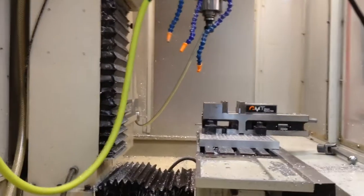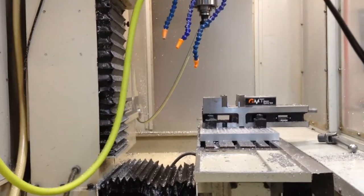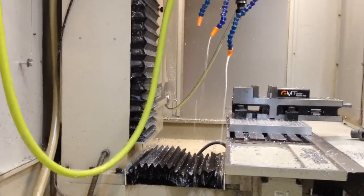Let's turn the coolant on — there's a good chance this is going to spray me in the face if these nozzles move. Yeah, that was definitely splashing me in the face. But you can see it drains down. You can actually see where it washed some chips out of the machine. The first pan catches all the big ones, the filter media catches all the fine ones — you can see some smaller chips in there. That is how that works.